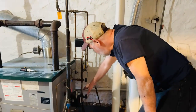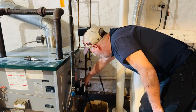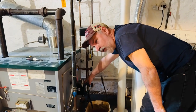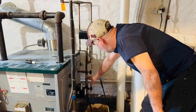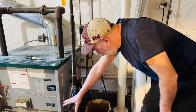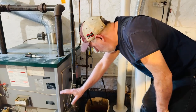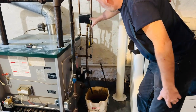What we've got is the low water cutoff — we drained the water to trigger the low water cutoff while the boiler was running and hot. Now what's happening is it's shut the burner off, which is its primary job as a safety device, and it sent a signal to the feeder.